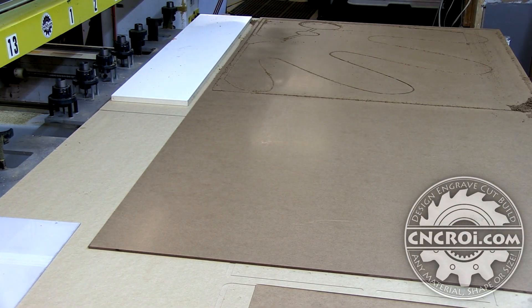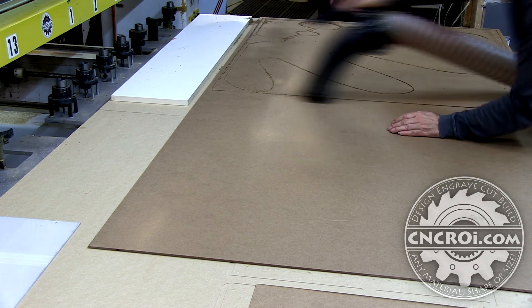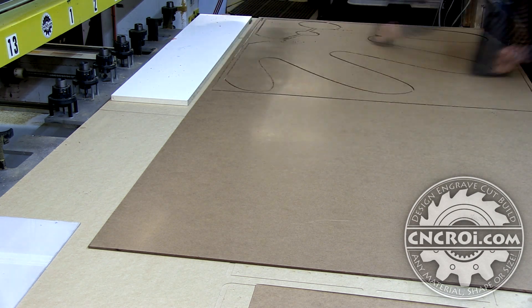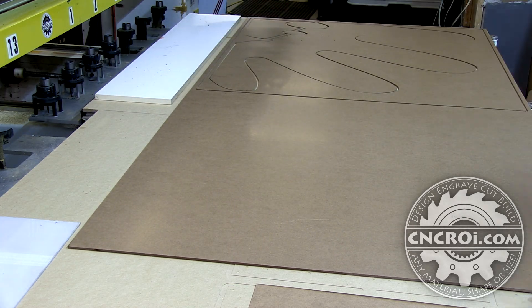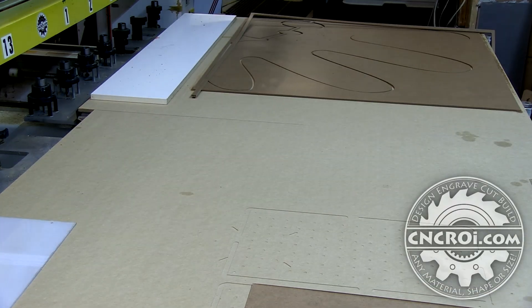The material choice also affects the thickness of the support material. So let's say you needed an eight foot by eight foot stencil like this, but you needed the supports to be under an eighth — maybe one sixteenth metal — you would have been okay with that. But here with MDF quarter inch, you're not okay; you need to go a lot thicker. So there are a lot of little variables you have to keep in mind when it comes to stencils.